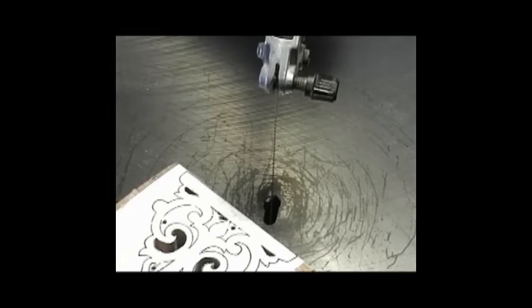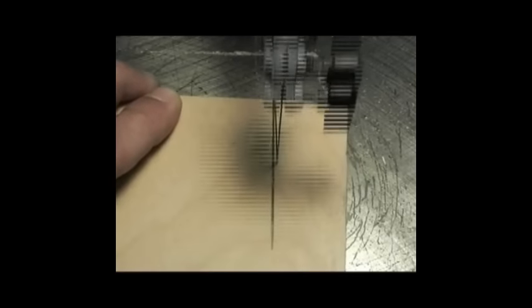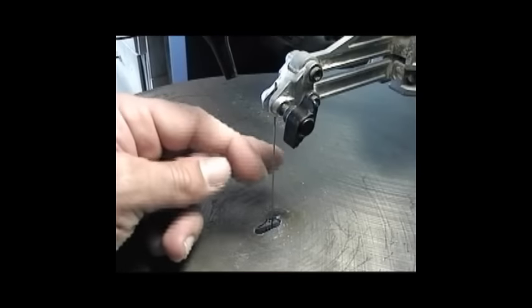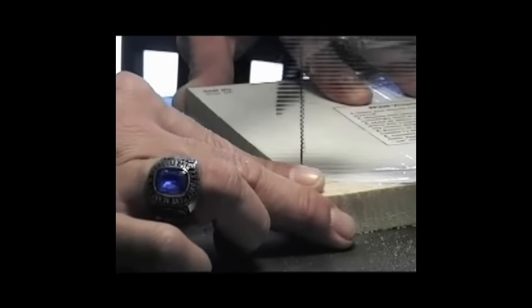Blades without proper tension or that lose their tension while cutting will wander and will make it much easier for you to inadvertently place side tension on the blade, resulting in beveling as well, a disaster for stack cutting. A blade is properly tensioned when you can tighten it and pluck it with your fingertip and it sounds like a guitar string.